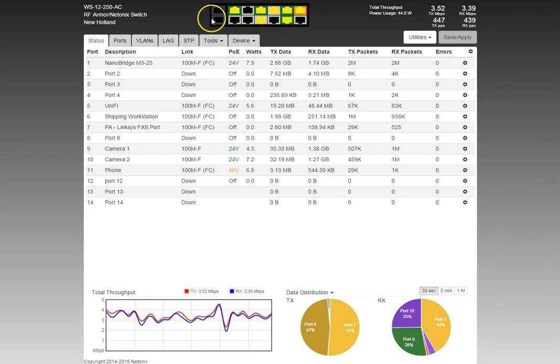If there were an SFP module installed, the outer shell would be light gray, and if there was a link, the center would be a color. Red stands for 10 megabit, yellow is 100 megabit, and green is gigabit. Coming over to port number one, it has a green outer shell.